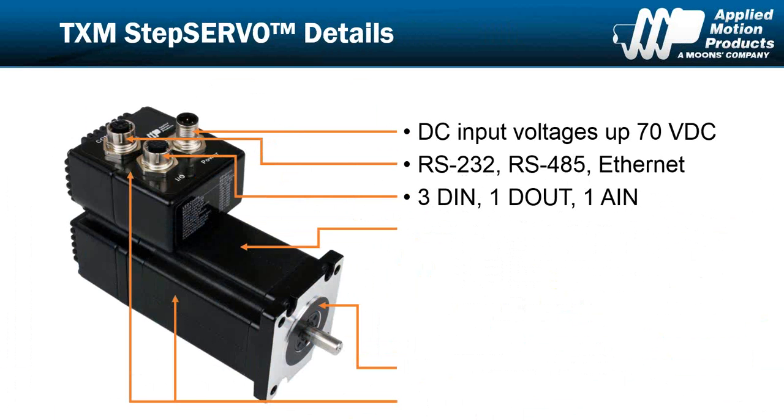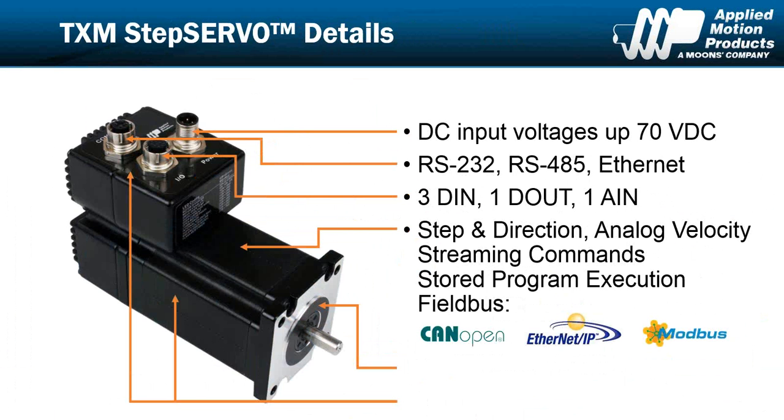And then the third type is the TXM. Again, same input voltages up to 70 volts DC. You can get it with any of the COM port options, 232, 485, or Ethernet. It has the same I/O as the SSM, so it's got 3 digital inputs, 1 digital output, 1 analog input. It can do all the control modes, from step and direction all the way up to the field bus options of CANopen, EtherNet/IP, Modbus. It comes in a NEMA 24 frame size.